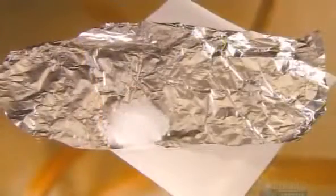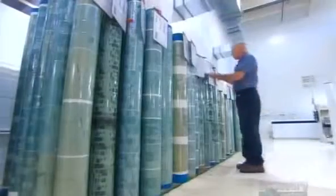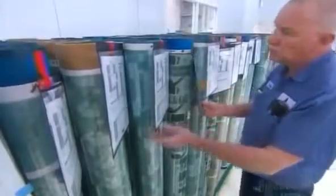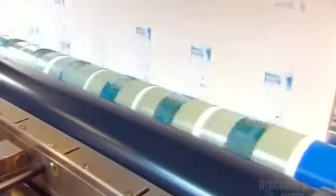Tetra Pak containers are made entirely from recyclable materials. The first step to making them is printing. A worker selects the appropriate printing plates for a given customer and applies them to the cylinder of a printing press. The press transfers one color at a time to the paperboard layer, using solvent-free ink. A Tetra Pak container can have up to six colors. At full speed, it takes only minutes to print. A strobe light visually stops the motion, helping the pressman check the quality of the printing.